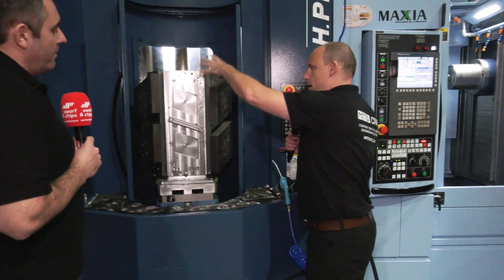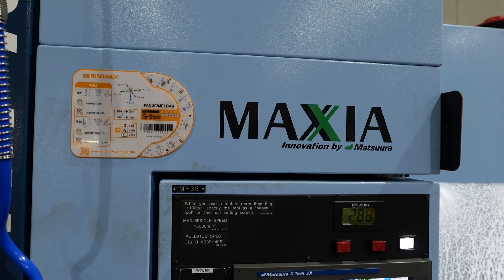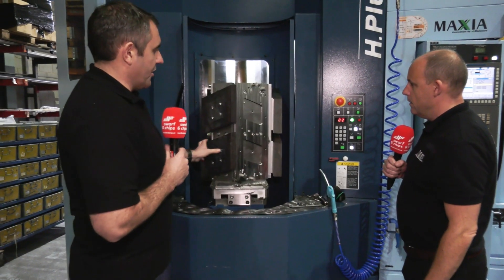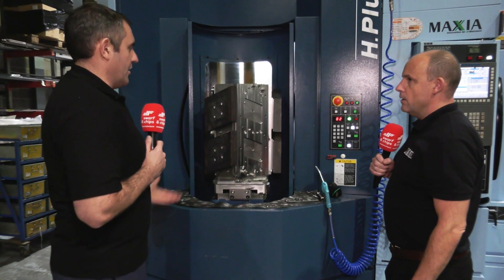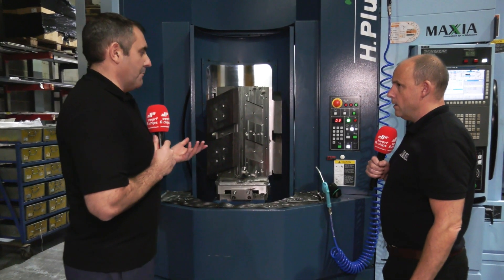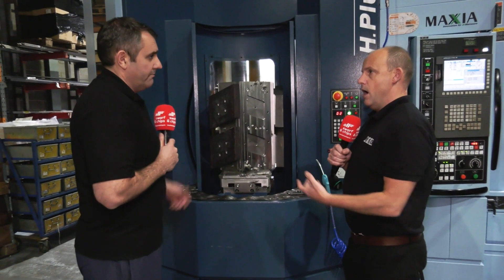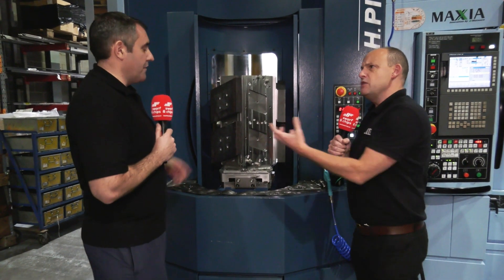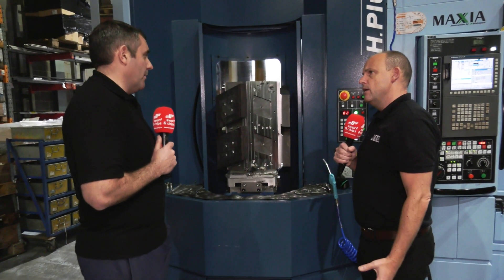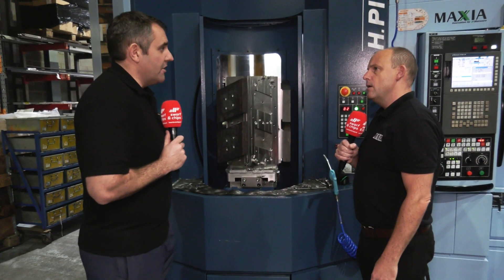This is one you've made here which we've just seen in its raw state. You put the plates on the side and machine the other faces in situ to make sure it's precise and geometrically accurate. This is an Op 2 part — you can see we've got six on. The H Plus 300 has a 300 base but it's quite a big tomb. We've had to take into account the 250 kilo load limit, so this particular tomb has been designed out of aluminium and it's all hollow. We haven't seen any vibration issues — we are using 80mm high-feed tools and 40mm porcupine tools with no problems.